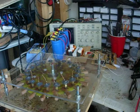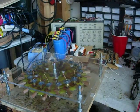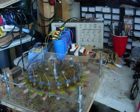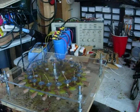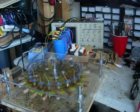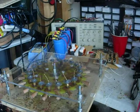What I found interesting was the transformer primary — it's a ferrite core for high voltage transformers used in televisions and such. There are 250 turns and a 12 volt primary pulse going in. The three secondaries are 217, 169, and 113 turns. It should be a step down, but what I'm seeing on the three blue caps back there: the 217 turn secondary gives me over 100 and some volts, the second gives me about 70 volts, and the last one — the closest one to us — is about 49 volts from a 12 volt primary impulse.